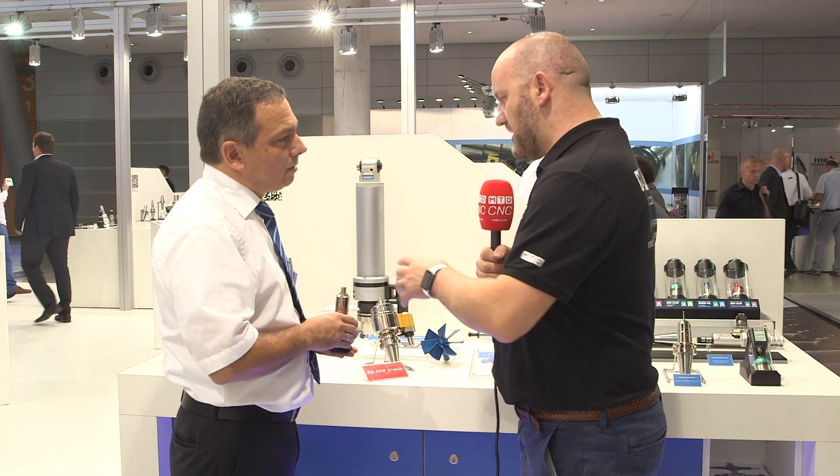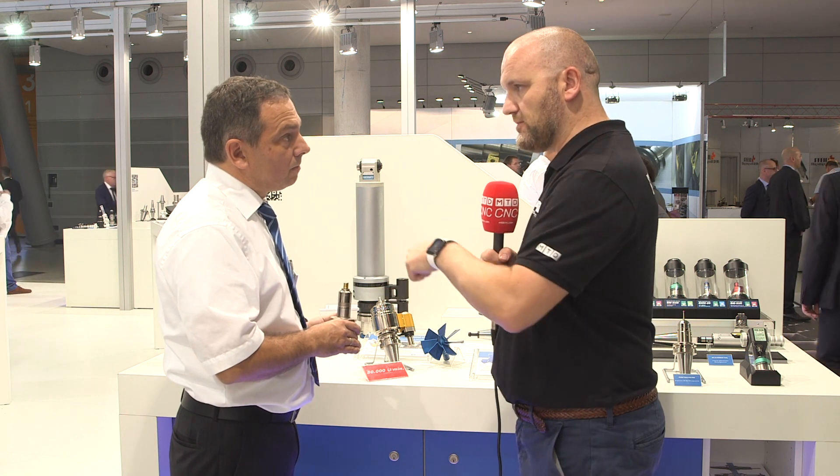Because it's driven by air, the machine tool's own spindle stays stationary at zero RPM. So if you're doing lots of milling on a large component but need to do some small profile milling, you're saving your machine spindle. The spindle is only running via the air turbine, which is good for the machine.